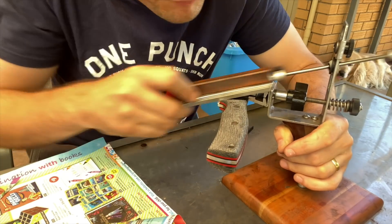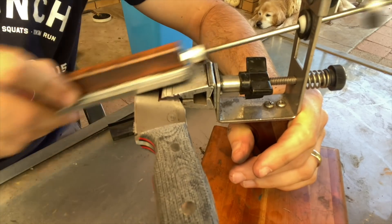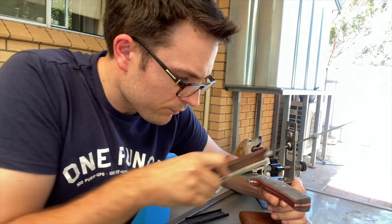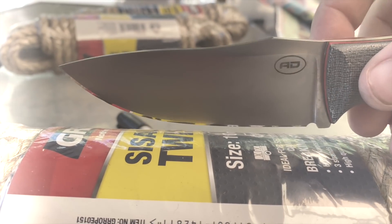So that's what's new about this steel. What may be newest about it is that it's a gradual quality improvement, and lots of these changes might actually be more towards the makers rather than the users. Maybe this is better to machine. One thing I have noticed is during sharpening, this is a lovely knife to sharpen, and this is at 62 Rockwell — it was an easy sharpen. I used my 300-grit diamond KME stone to do the minor bit of reprofiling needed. It came with a wonderful edge but was at about 18 degrees, and I just redid it to 17 degrees, making a nice mirror-polished edge.